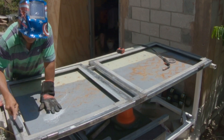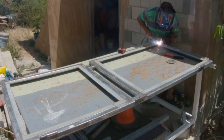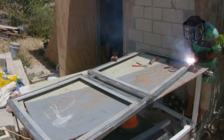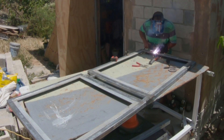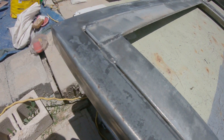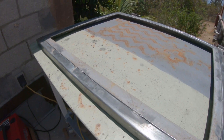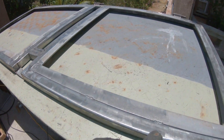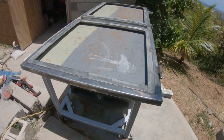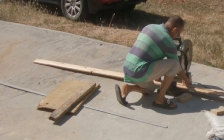I usually take a wire brush and clean up the welds. I'm giving it the inch-and-a-half to two-inch welds — I'm not welding that flat bar all the way, as that would take a lot of time and welding material. You can see the short welds and the spaces. I filled that with Bondo. I'm not a body man — kudos to those body men who are patient doing that detail work; they earned their money. I learned from attempting it just how much it takes from you.